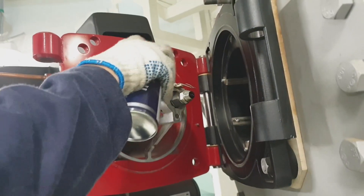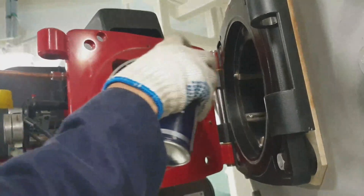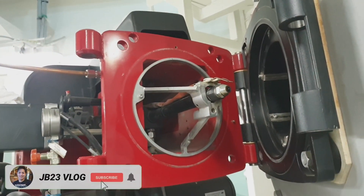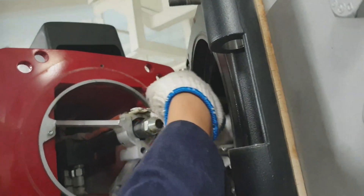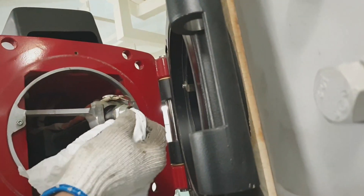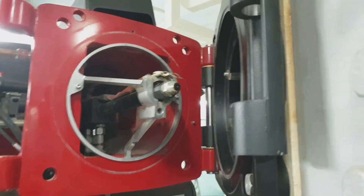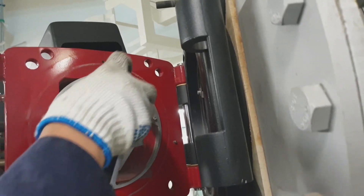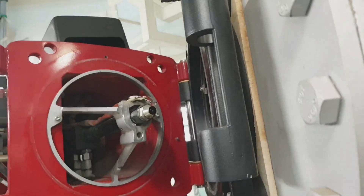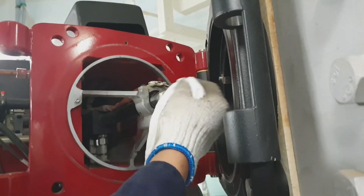For the electrical parts I am using contact cleaner to clean the electrode probe, and for the atomizer I am using oil penetrant to clean it with the compressor. The frequency of this maintenance is done once a week as per PMS instruction.